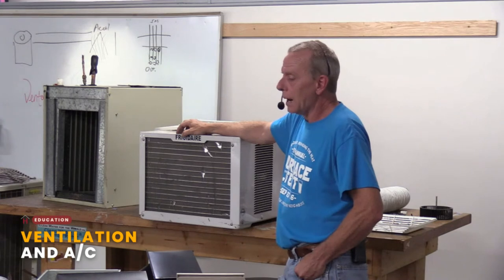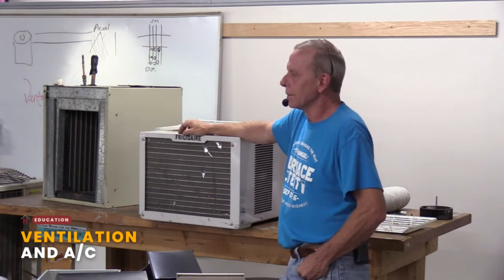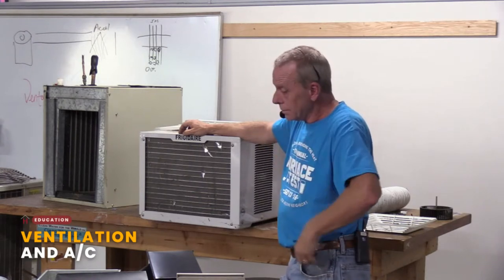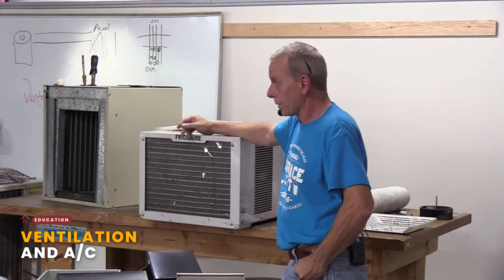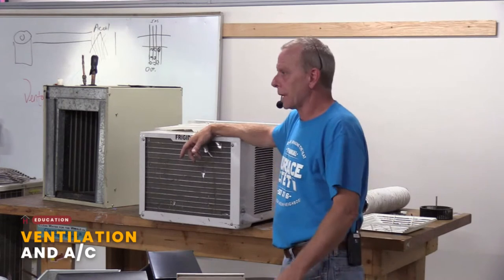If you're doing it right, they will do what's called a Manual J calculation, and I'm sure there's another word for it that I'm not thinking of right now. They'll actually take a lot of that into account. If you are truly serious about it and you're having a company come out, talk to them. How do you size the furnace? How do you size the air conditioner? If they go, oh, you've got a 1,100 square foot house, you need this big of a unit,